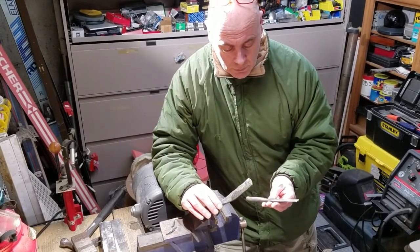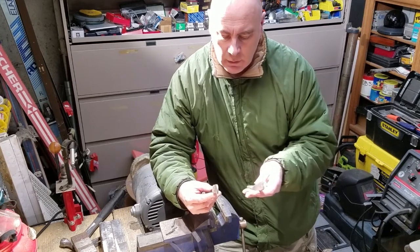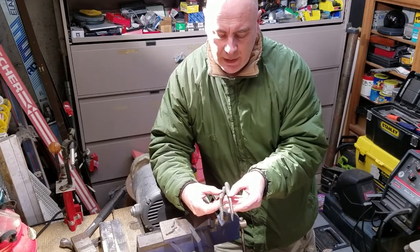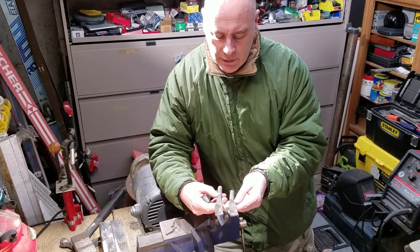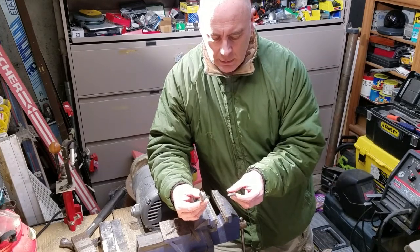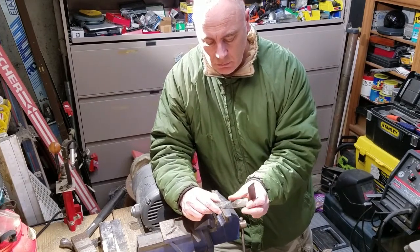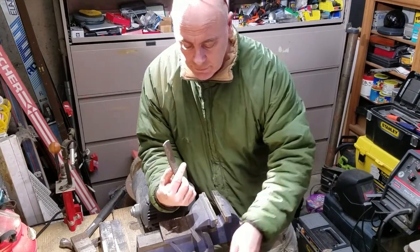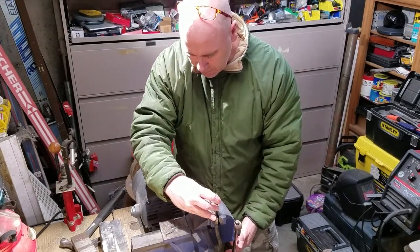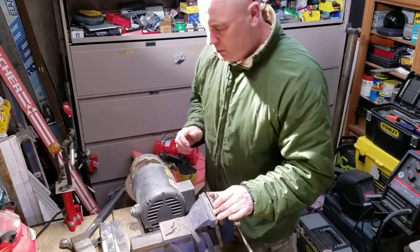Here we have two pieces of coil spring that have been quenched in water instead of oil, like in the last video. I got some advice — I worked them about an inch wide, maybe an eighth thick, and I did them at two different temperatures. This one was immediately out of the forge, this one at a slightly lower temperature. We'll probably do this one first. First thing is secure it in the vise — it's a swivel vise, hopefully it's locked in place.